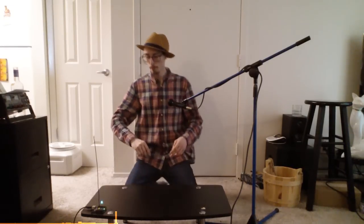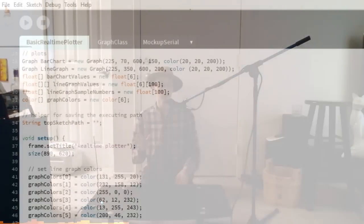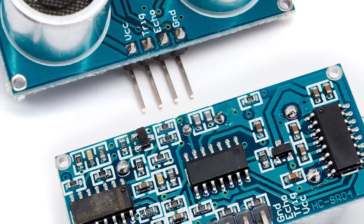It's really picky — it's not perfect. It likes objects of big mass. So if I move my arm back and forth, it might pick it up a little bit, but if I move my whole body, it's going to freak out — it likes bigger things. So it's not really good for arms. Your foot it's going to pick up because my whole leg is moving in that case. But you can use this without any components to basically detect presence of living things in a room. For Internet of Things uses, you can use these to statistically see where all the motion in your house is without paying $10 per PIR sensor or setting up ultrasonic sensors. It's just wires.